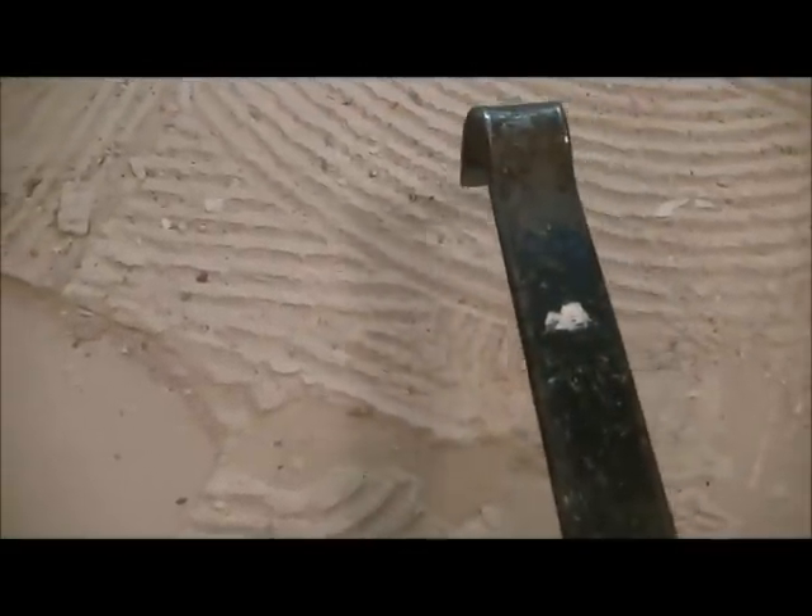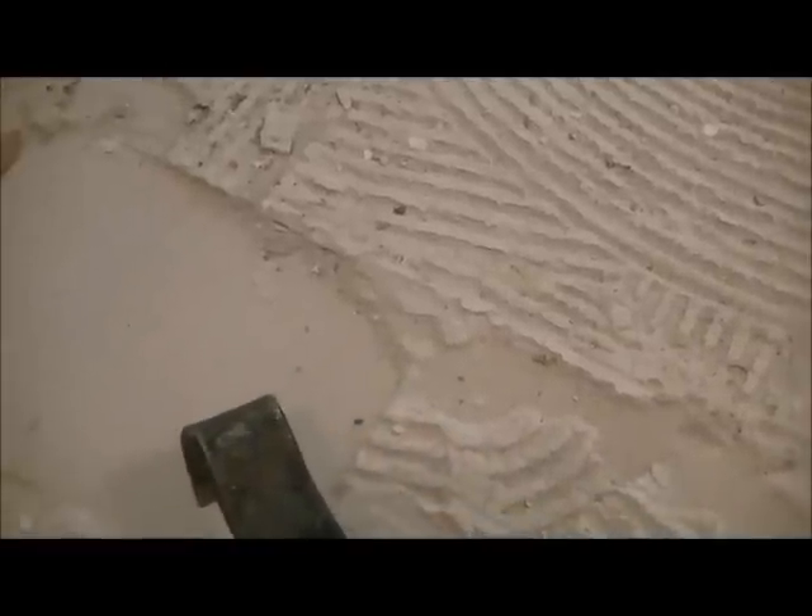So this is a big no-no. Don't glue and screw your backerboard — there's no point. Put enough nails or screws in to hold it down, put your tile down, and let it alone. This is just chaos; a lot of trouble for nothing. I can't use the surface of this — it's not like I can go back over it and tile. It does have to come up, and I had a lot of trouble, headache, blood, sweat and tears for no reason whatsoever.